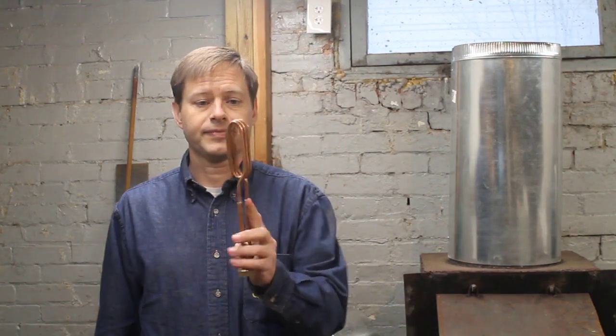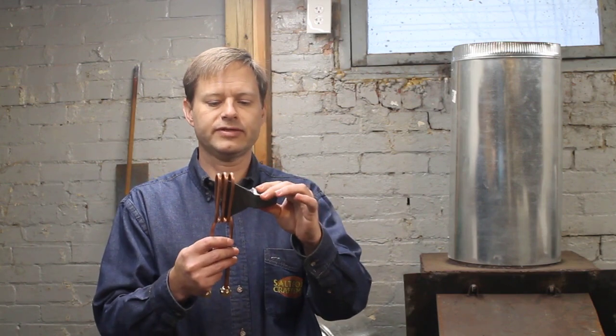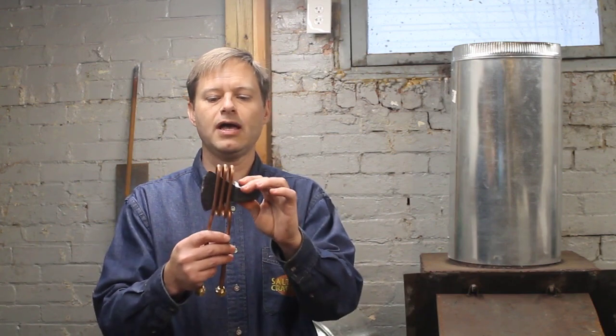During heat treating I decided to make another coil - it's about three and a half inches by three quarters in the middle and designed to be just perfect for this. I'm sure I'll find many other uses for it over time. It was great for doing the heat treating of this blade, and it would have also been handy when I was actually forging out the blade, especially the planishing part at the end where a full heat across it would be good. As Jim Koch says, forge on and make beautiful things. See you next time.